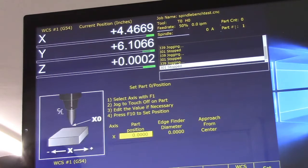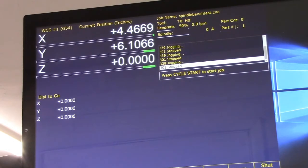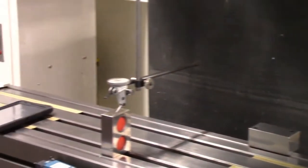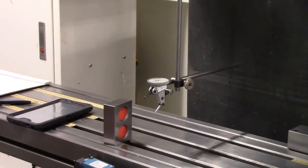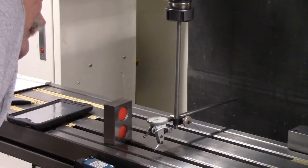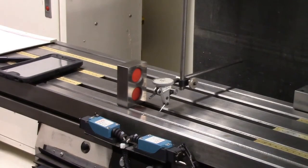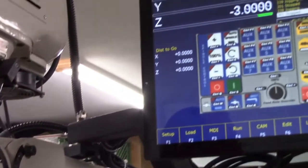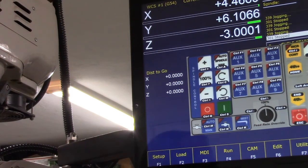Get back to the main display, jog panel, bring it back down. Move the block out of the way, fast jog down, slow the jog down, Control-F. Going into incremental, going to tenths. Pretty close. Our Z-axis is set.